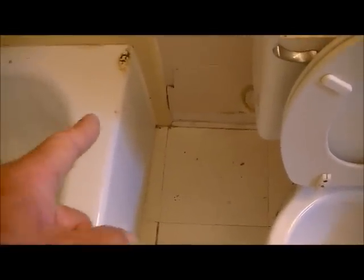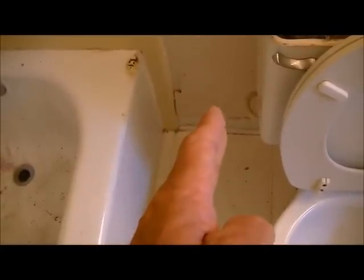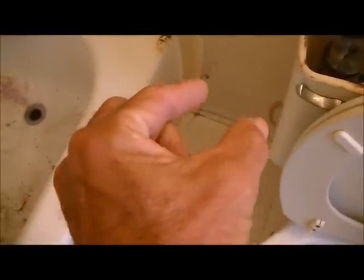At that point I'll take out the fixture. Obviously they're going to buy a new shower fixture — it'll still go on the same side. I'll build a curb. In this case it looks like I have about probably a good part of a foot, if not 14 or 15 inches between the tub and the toilet, so I'm going to try and put the curb out a little bit further so I can get a bigger shower out of this.